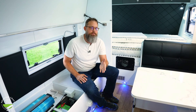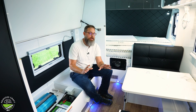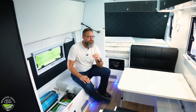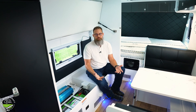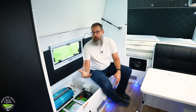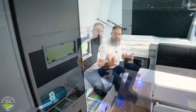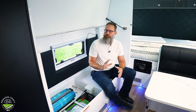Something I'm always concerned about is surge protection — surges and spikes hurting your equipment. But I'm equally concerned about low voltage, sometimes called a brownout. Low voltage is at least as dangerous for your onboard electronics as a high-voltage spike. Circuit boards can overheat, and any equipment with a circuit board — whether in this bay or your refrigerator — is at risk. The Battery Plus 35 has protections built in for low-voltage situations to protect itself and attached equipment.